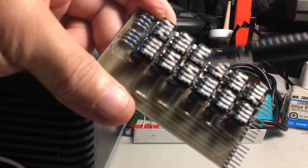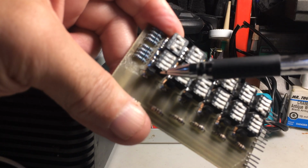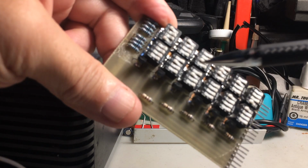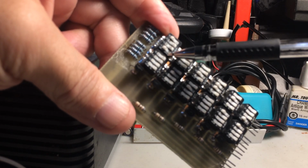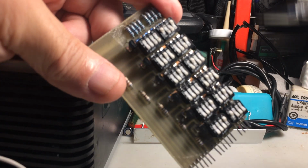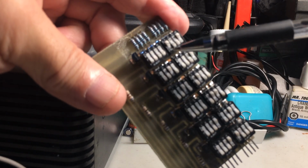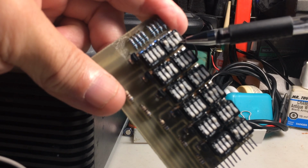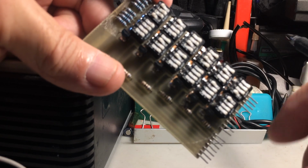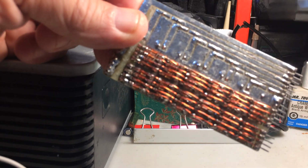All right, and of course that's the trend for every single row. So each time the transistor is switched on by the control lines here, this sequence of data appears at the data outputs, all right? And the beauty of this little circuit is that I can at any time just open a switch and close it to give me a different data output without having to physically remove the diodes and put them in a different place.